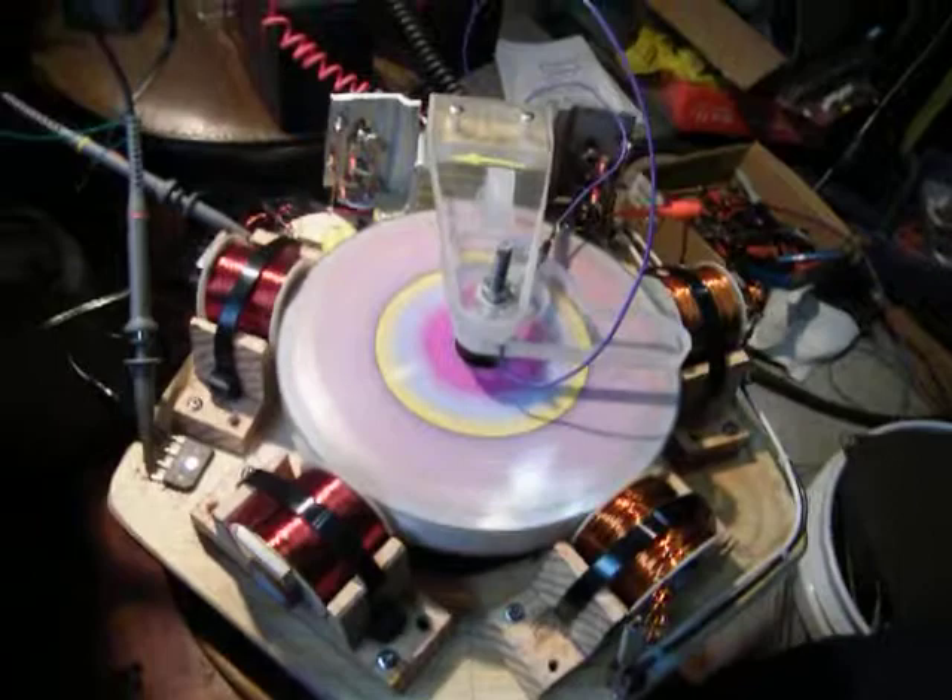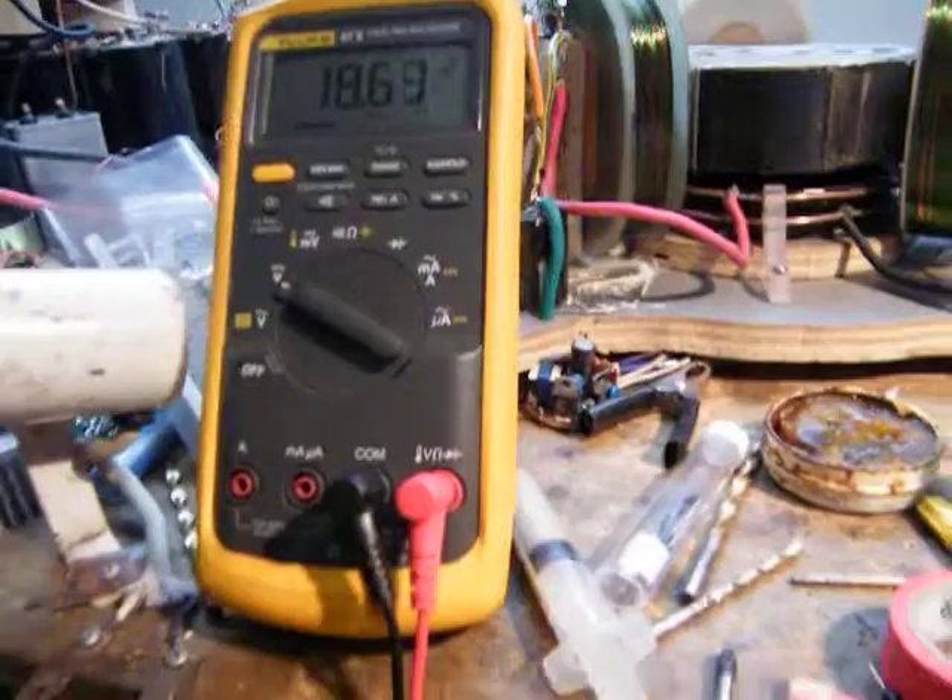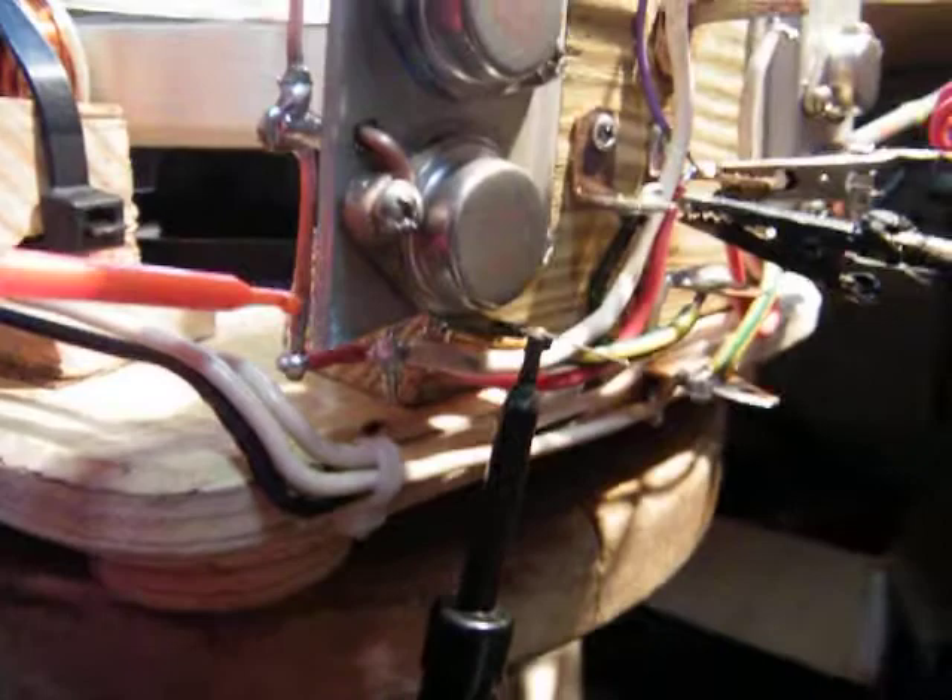What we're seeing on this meter over here is the back EMF being created across the emitter, across that coil — the drive coils. There's a diode there coming off the emitter, and the other end of the meter is attached to the collector.